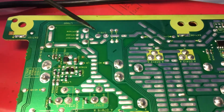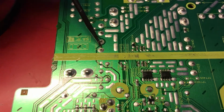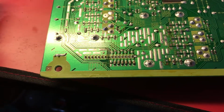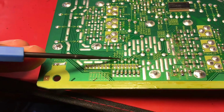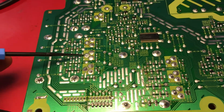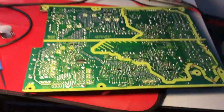The supply voltage goes across the transformer here, which is actually switched from the drain as well, and that's rectified by two Schottky diodes, and then goes over to two big electrolytic smoother capacitors. That voltage is routed to the other side of the board, the corner side, which is the LED plus output. And from there we have 6 return circuits. Okay, 1, 2, 3, 4, 5, 6, 7 actually, because one of them is not used by the board. This panel consists of 6 LED strings, which are separated into 2 blocks, like left and right strips, but overall 6.